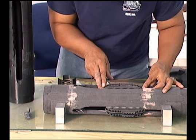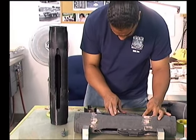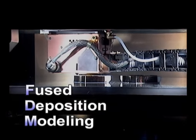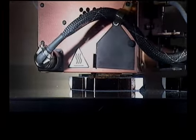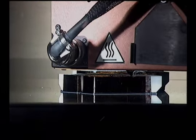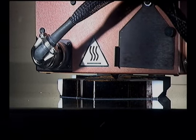This system can be used for rapid prototyping or short run manufacturing when tooling for one or a few products is not cost effective. FDM, or Fused Deposition Modeling, uses a type of three-dimensional printer with the advantage of producing a rugged, dimensionally stable product, with the same high precision as conventional CNC tools, without the time and expense of molding, casting or machining.